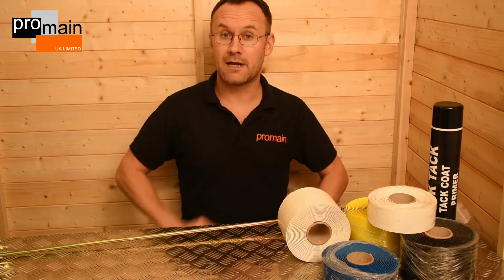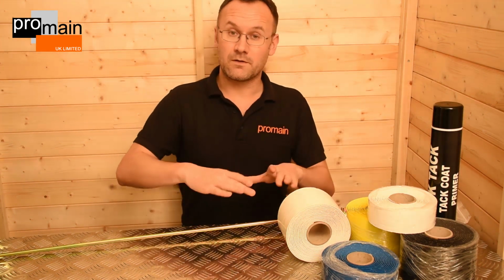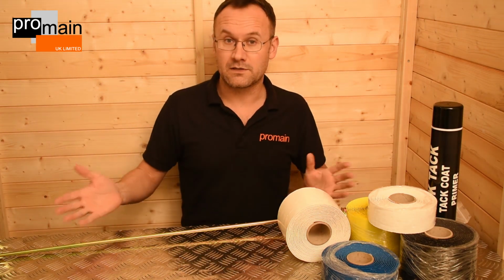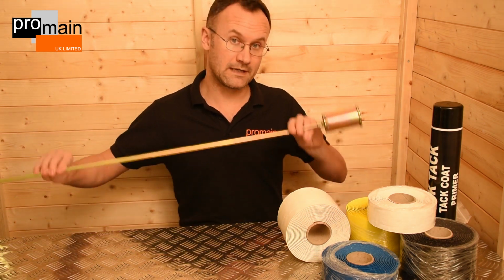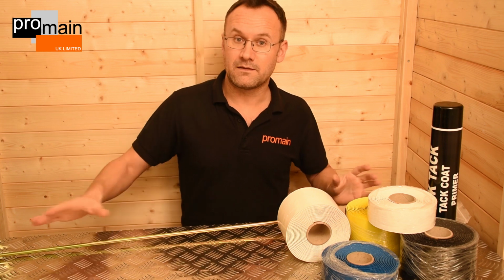So let's talk about preparation first of all. What you're going to need to do is make sure that the ground is free of any loose dirt, oils or any moisture as well, and you can warm up the ground with the thermoplastic gas torch, which you'll need to use later on. Now what do you do once you've prepared the surface?